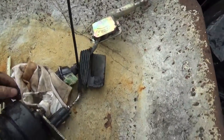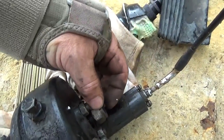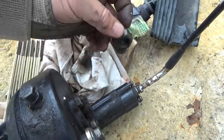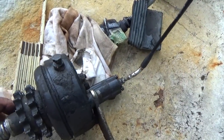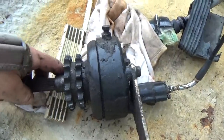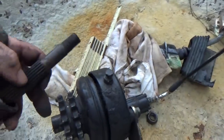To take this apart it's not that big a deal. You just take this bolt out — I had to remove the smaller bolts first to get a socket to slip in on the bigger bolt, but I've since put those back. You take this bolt out and this shaft will slide out, hopefully it cooperates. And there we are, done.